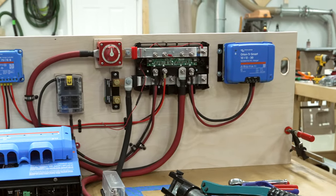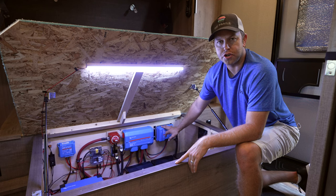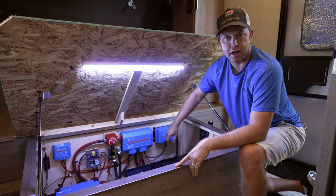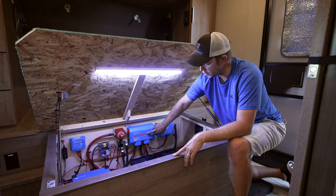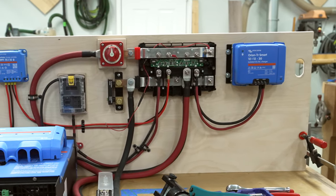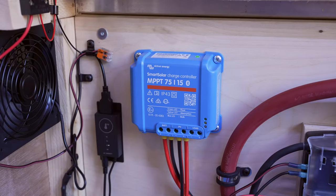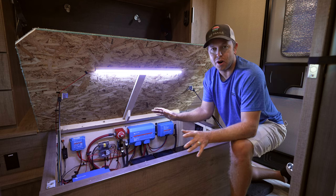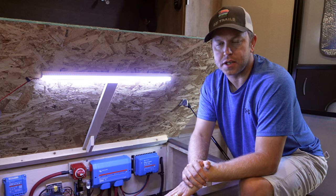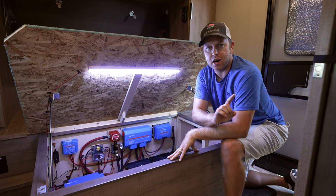I'll walk through how we have it set up in my parents' camper. On the first slot we have a fuse going to the DC-to-DC charger — the Orion DC-to-DC charger is basically a 30 amp charger while you're driving down the road, kind of a backup generator. The next fuse in the Lynx distributor fuses the 3000-watt MultiPlus inverter charger. The next slot goes to the Victron MPPT 75/15 solar charge controller. My parents opted not to go with any solar on the roof — they're going to do one 200-watt portable solar panel from Rich Solar, and that charge controller is for that. The last fuse in the Lynx distributor is for the 12-volt system on the camper, wired into the original OEM black and red wires off the chassis.